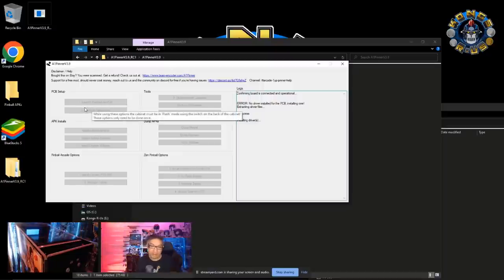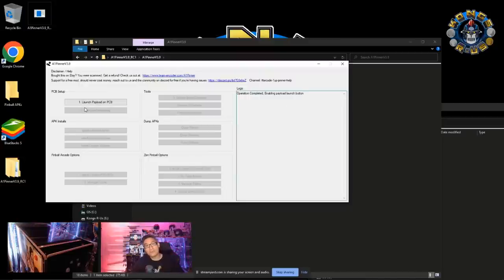So if you're doing this for the very first time, you're gonna need to do this and cycle it on to make sure that the drivers are installed. So this could take anywhere from about 30 seconds to a minute or so. If people are having issues at this point, double check all of your USB cables and connections. Make sure that the USB cable is going all the way into the PCB on the pinball machine. Make sure that it's connected into your PC. Getting the right USB cables makes a huge difference. I'll link a couple of different versions of cables that you can use in the description below. But once that's set up, then you should be good to go.